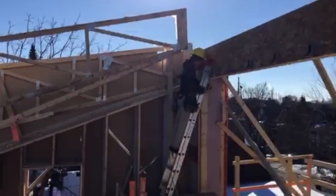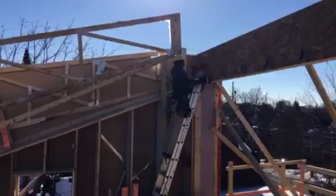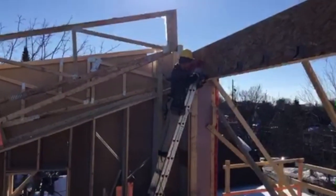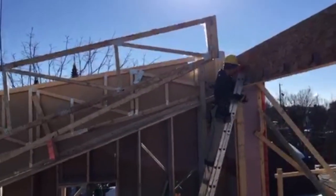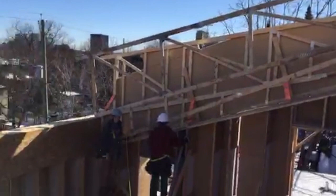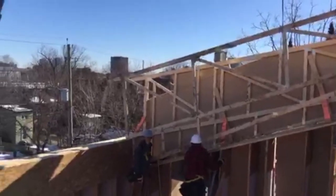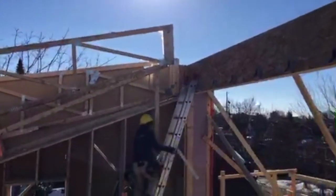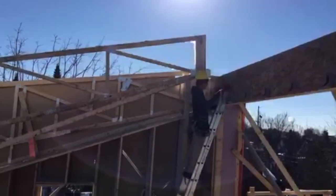I thought we had them in the right place the first time. But isn't your new wall sitting on here? Yeah. The wall isn't 24. No. The first hanger should be 24 from the knee wall, at the most. That's why originally when I said we should line them up with the wall studs, that made the most sense because they're spaced roughly 24s as best we could. So we're going with the studs. Doesn't matter if we go with the studs or 24 to me because they're supported on either side. We just have to get the spacing right. 24 on center from that wall.